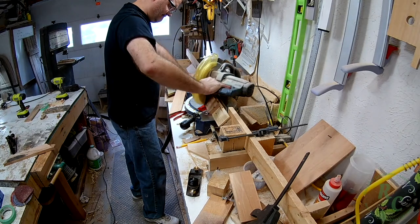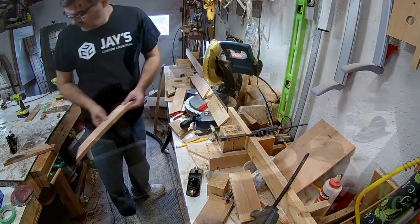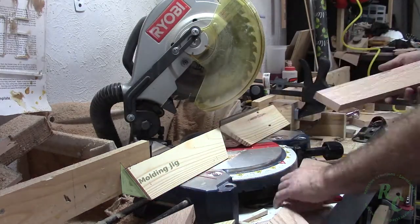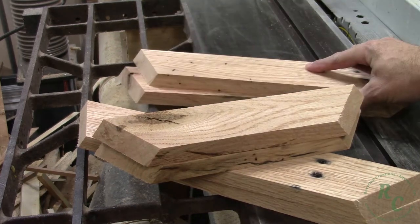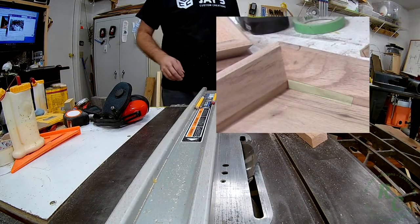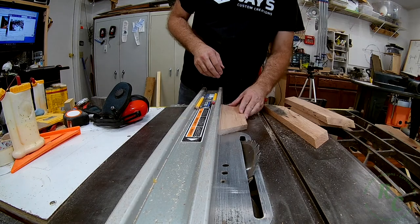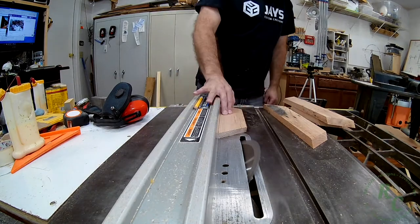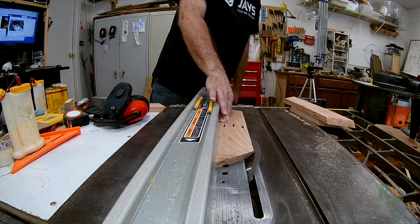I don't like to modify the 90-degree setting on my chop saw, so I install a molding jig which I constructed in the shop on the bed of my chop box. Using stop blocks is key to making sure that the long pieces and the short pieces are all of equal length. The first cut is this little interior wall at the bottom of the box. To accomplish this we set the saw at 45 degrees. Hindsight says I could have cut this 45-degree angle before I cut the pieces to length at the chop saw.